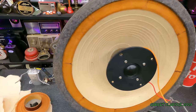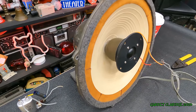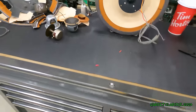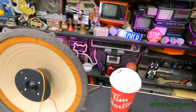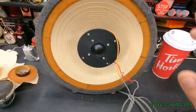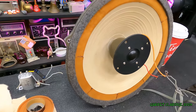Yeah, with this dome tweeter on here, that helped a lot. Like, that just changed the whole situation here. Those tweeters are totally crap. But these would be awesome as just a mid-high. Without an equalizer that's still a little harsh, but again, this is just free air. If we had the L pad for the tweeter going, then that would help a ton as well.